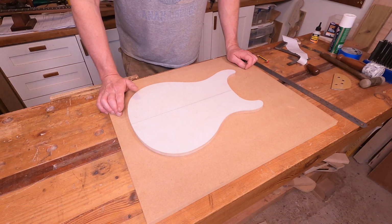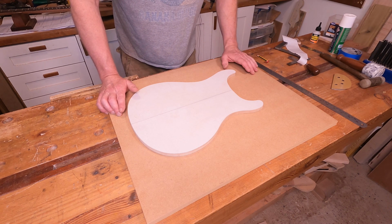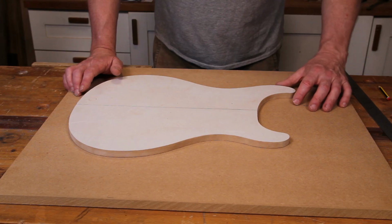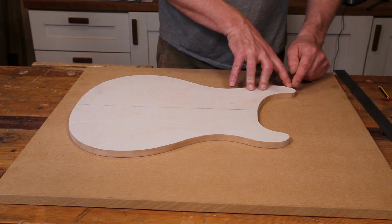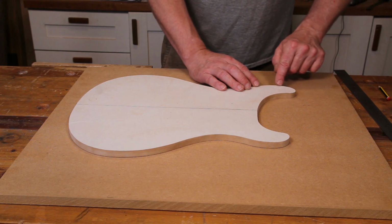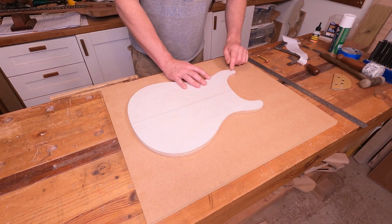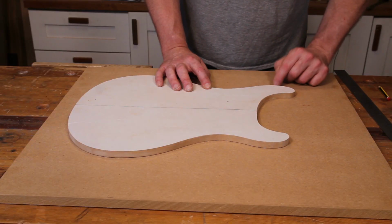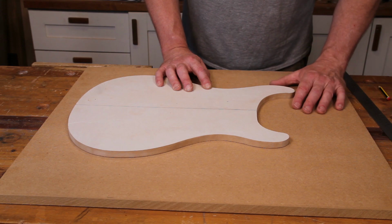Part of me says, go on, try it, see what you can do. But the sensible part of me knows that there is just no way on earth we'll do it without the plies cracking. So what I'll have to do is bend up to the point of the curve here and to the point of the curve there, and then make a little walnut block that will sit in both of the horns, and then we can recess those blocks so that the ribs can sit into them. It will mean there'll be some joints. Hopefully, if we get the joints tight enough, they won't be too obvious.